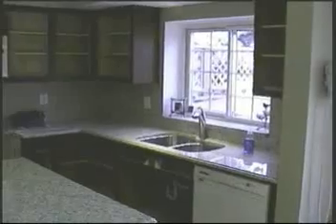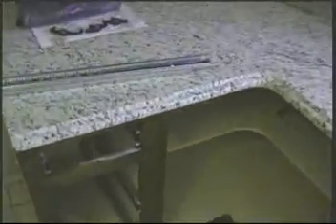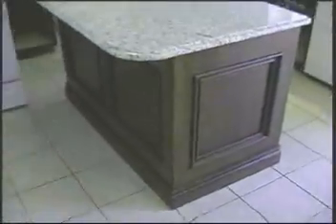We'll be touching up the edge of the stain where the veneer had to go over the edge of the sleeve, filing it in, then using a light sandpaper with a little stain and some top coat. Now you can see the granite tops are in. We have the shelf in the corner cabinet — a very nice open corner section. We make these cabinets a little different than standard: one side at 42 inches and the other at 36 inches, giving a much larger opening into that huge back corner space. The crown molding is on and it's basically ready for doors.